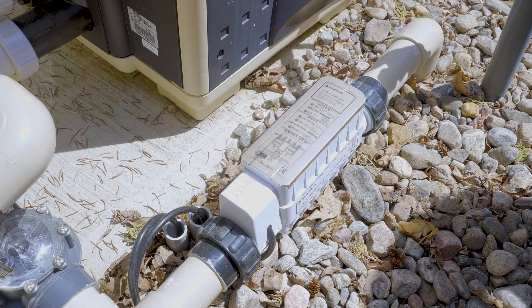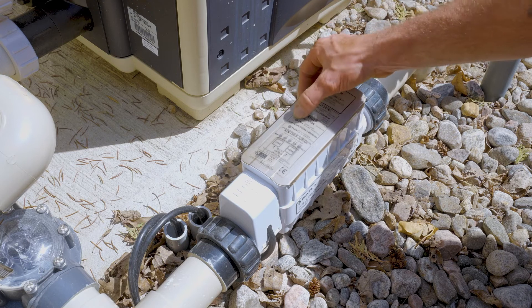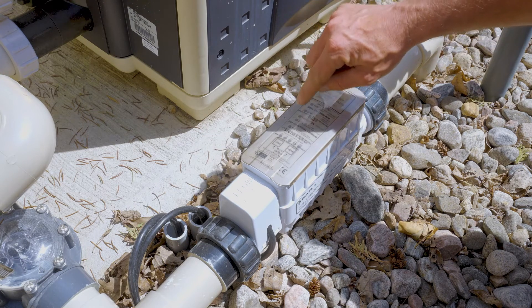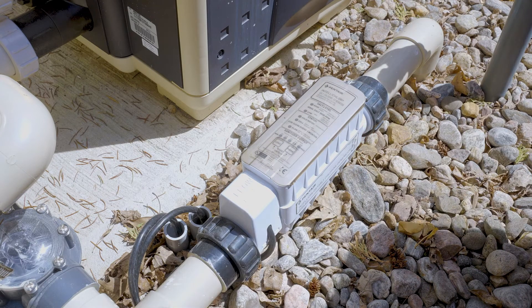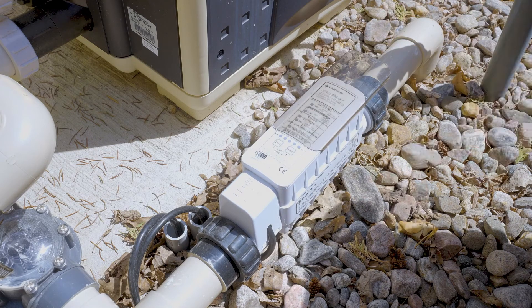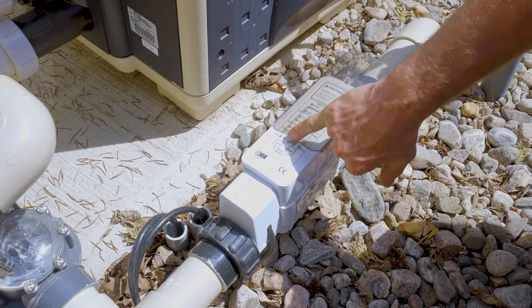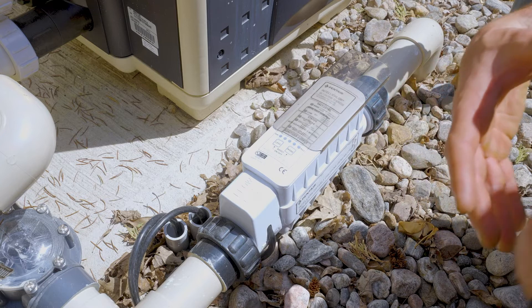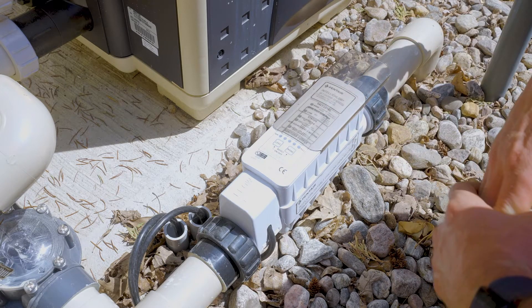For all intents and purposes, that's green — when there's flow, this is green when everything's operating. So you will see green, green, green across the board. The next box down is our sanitizer output. I don't know how much you're going to need for your pool because every pool is different. If you notice that you need more chlorine, we just slide this panel up and you can hit 'more' and you'll see these green numbers light up showing the percentage amounts. If you have too much chlorine in the pool, we can drop this by hitting 'less.' The green dots will drop and you'll produce less chlorine.